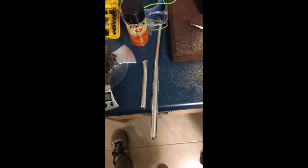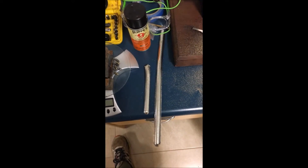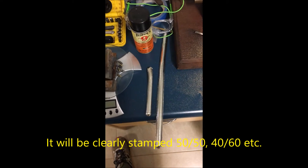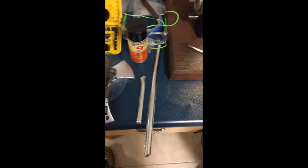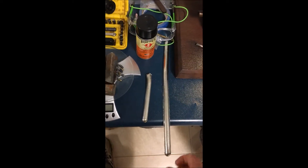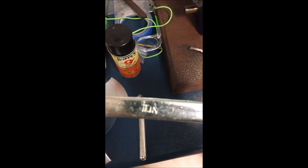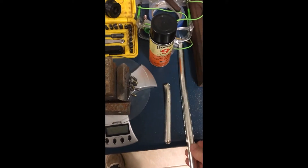It's worth keeping your eye out because there's still plenty of it knocking around - garage sales, selling stuff off, whatever. You may find 40/60 and others too, but they have less tin so you're best looking for the 50/50. But when I couldn't get the 50/50 bar solder anymore I went to a metal supplies place and they actually have pure tin. These are 500 gram sticks of pure tin. I had to buy $150 worth but that's enough and I've still got heaps of it.